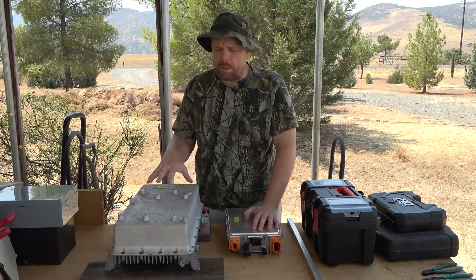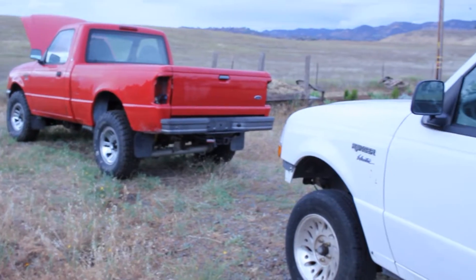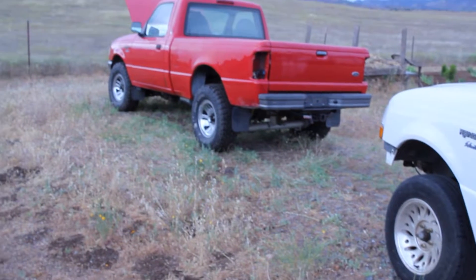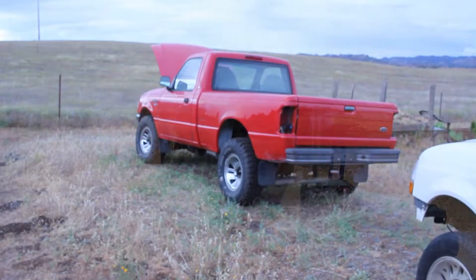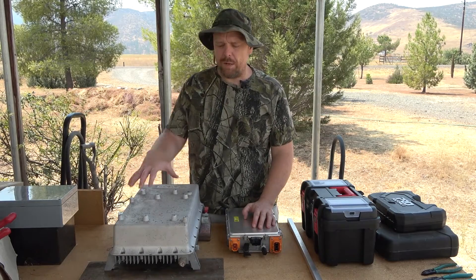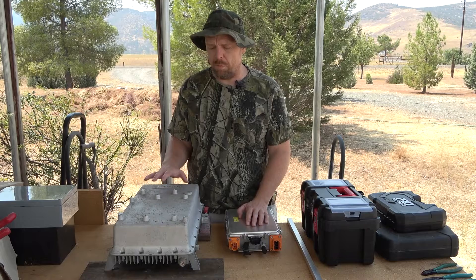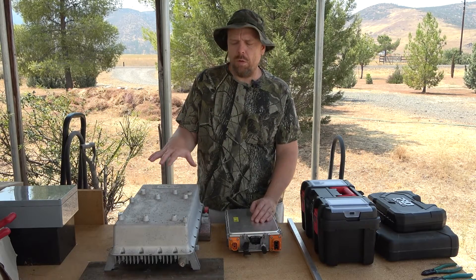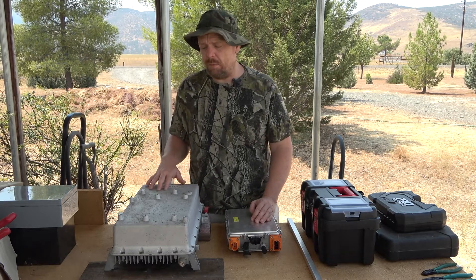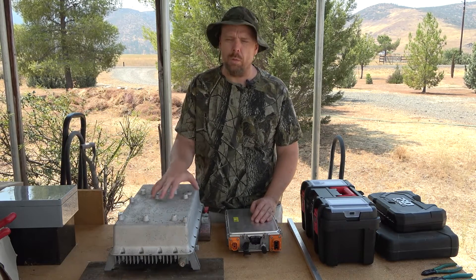This one was set up for NiMH. What I do not know is if this is the same charger used in the lead acid Ford Ranger electric. As far as I understand it, they're both constant current, constant voltage — the CC-CV that's so common for all these different battery charging profiles. But the NiMH Ford Ranger electric has what's called an independent observer module that actually controls this charger. There are also different heat requirements, power requirements, and cycling requirements for NiMH.